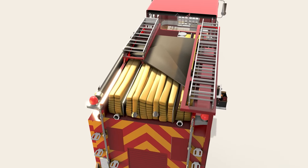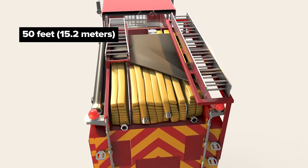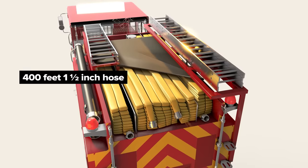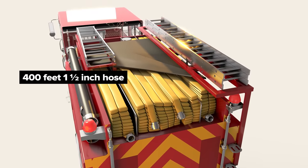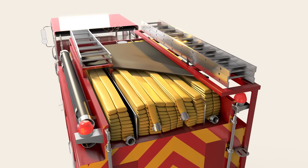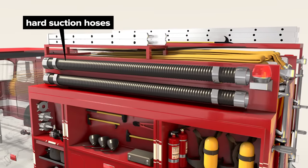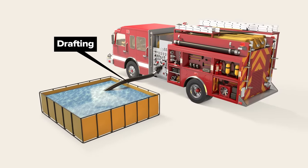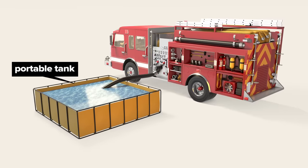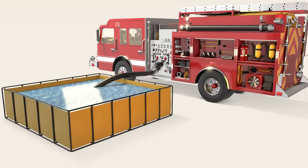On top, there are hose beds for storing various hose diameters and lengths. An average length of hose is 50 feet; a pumper might carry around 800 feet of 2.5-inch or larger hose and 400 feet of 1.5- to 2-inch hose. For comparison, the standard city block in the US is 660 feet on one side. Also on top is ladder storage. On the driver's side, there are hard suction hoses for drafting — meaning pulling water from a standing water source like a pool, pond, or portable tank. When multiple emergency vehicles respond to one incident, tanker trucks may deliver water to a portable reservoir that other pumper trucks can draft from.